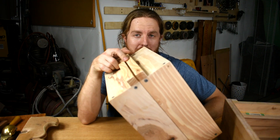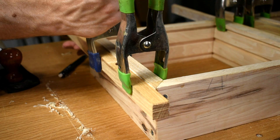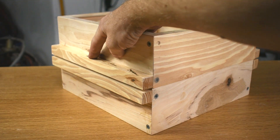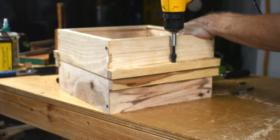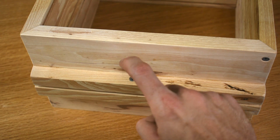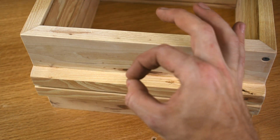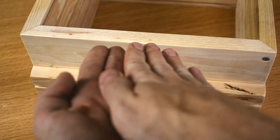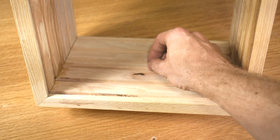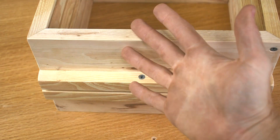Next step: these side flanges. They do multiple jobs at once. They're glued along the parting line on the top and bottom, not quite touching — maybe a sixteenth of an inch away — glued edge grain to edge grain, which is the strongest orientation for a glue joint. The reason they don't touch is because I connect them with a screw right here. This screw runs through the top into a hole in the bottom, and it will not go into that hole if it's not lined up perfectly. So putting it in that hole means the top is perfectly aligned with the bottom. When you screw it tight, it also pulls the two halves together under tension, which hopefully prevents molten metal from lifting the top and leaking out the edge.